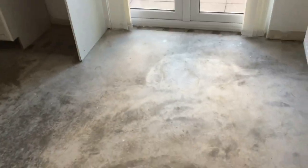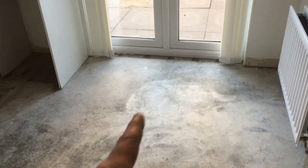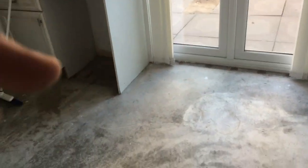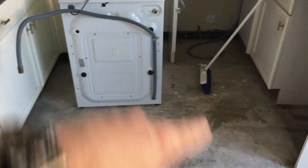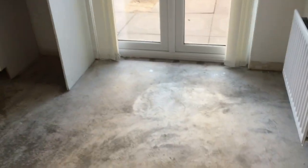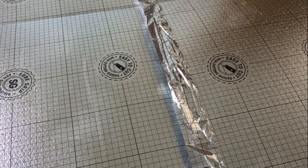The first decision to make when flooring is what way you run the boards. Normally you run them lengthwise of the room. This is the longest area of the room, but I think coming from the living room into the kitchen it'll look better if the boards are running parallel with the patio doors. So I'm going to run them across that way.